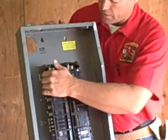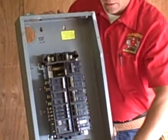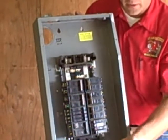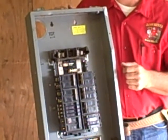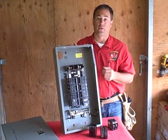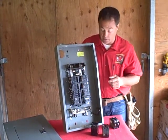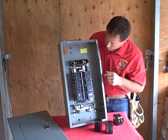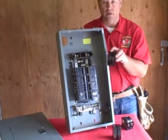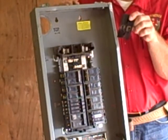What we've found is that there are a lot of houses that have circuits that are heating up and the homeowner has no idea until it's too late. A lot of times you'll see lights that flicker throughout your house with no reason or justification as to why. If you were to take off some of your breakers, you'd find that potentially you have some hot spots that are actually starting to melt the plastic and ruin the integrity of your breaker.